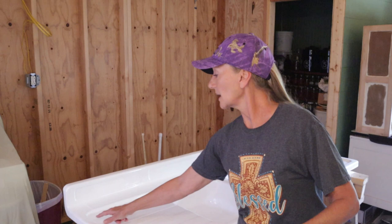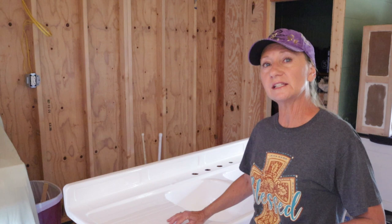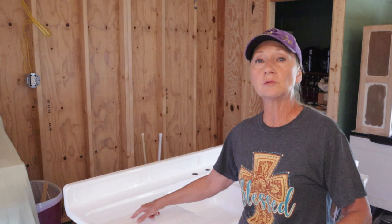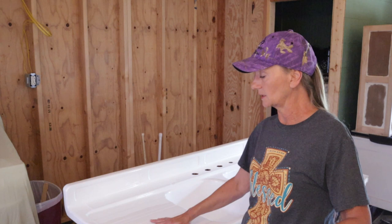Make sure you allow it to flow evenly on your vertical edges. Also, on a drain board sink like this, you have insets for your water to drain. The product is self-leveling, so it's going to want to fill in these ridges or insets. As you saw in the video, I took the roller they provided and used the edge of it from time to time to push the product out, which allowed it to flow down into the sink and prevented it from continuing to pool off the higher edges into the lower areas — helping me keep the integrity of the drain board.